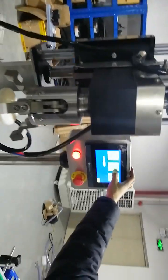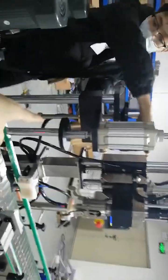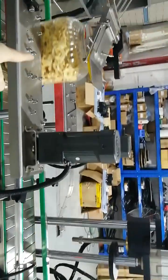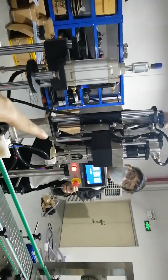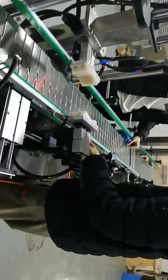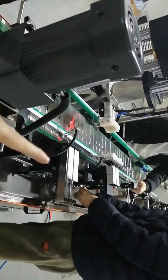Try to run the machine. To adjust this pressing cap device, make sure it is higher than the bottle top. Also, you need to increase the height of the capping machine.